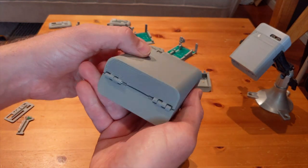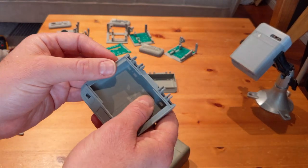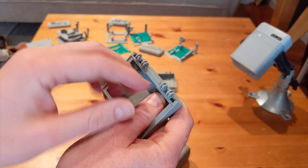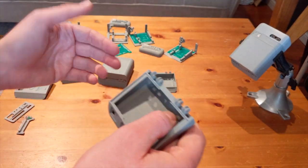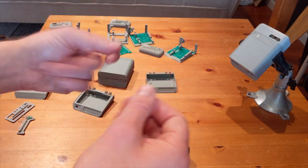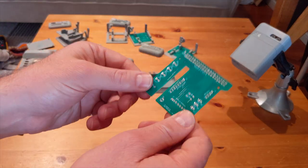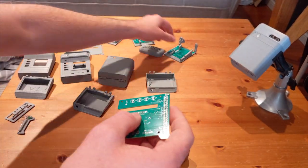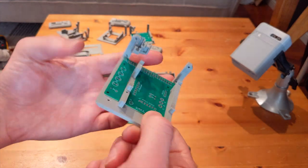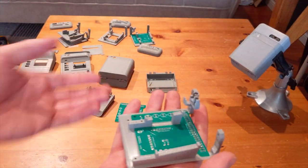Then I decided to look at how I was going to do the opening door. You can see these are very simple hinges with no pass-throughs for any of the electronics. Then I came up with another style of door using these chunkier interlocking circles, with larger ones that have channels big enough to pass through enameled wire — like speaker or motor wire. I decided to have custom boards built. This is the mainboard that goes into the chassis, and here's the most recent design.